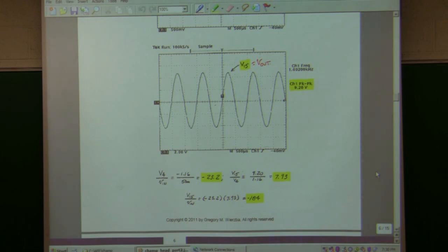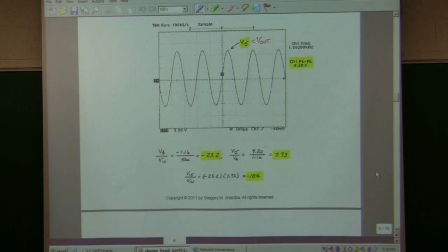But in the lab we have a little machine, we plug transistors in and we get the curves of them and we can gather the data from there. But for tubes, because you're talking about 300, 400, 500 volts, it's a little different setup. So it's a little bit different, although very similar in what's here.